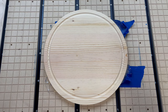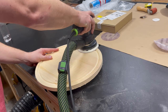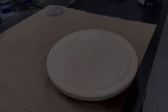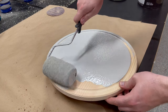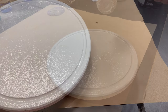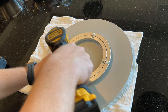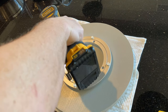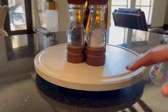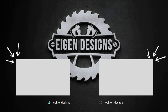This Lazy Susan is 14 inches in diameter, but you could do it much bigger depending on the footprint of your CNC. I take some 120-grit sandpaper and do a once-over on the top and bottom, then use my palm router to apply a chamfered edge around the top. You could certainly apply a stain and then a top coat like lacquer or polyurethane — the client I'm making this for requested it color-matched to their table and painted gray. The last step is to center the hardware on the underside and secure it with wood screws. This is a great beginner CNC project with lots of room for customization — family names, quotes, monograms, you name it. That's going to be it for this video — if you got value from it, consider subscribing because I've got more great content coming.